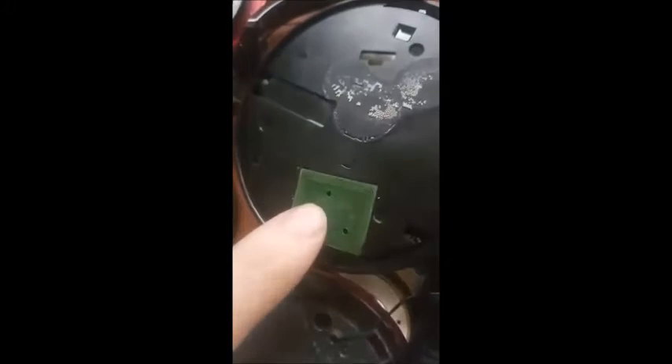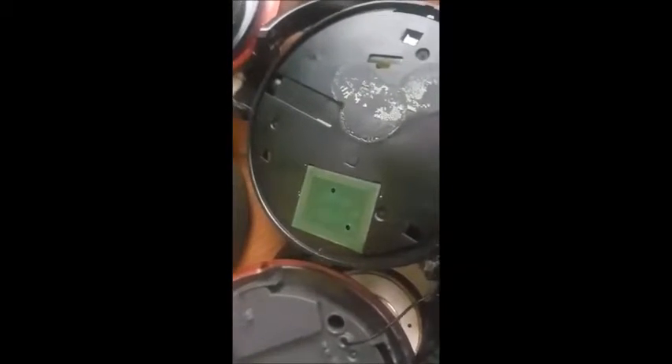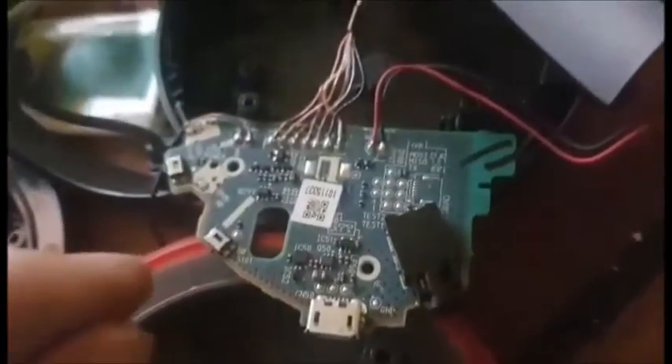With this Sony piece there's a tab there and a tab underneath on this side, then you can push it through - it's glued - and you can take out what I believe is the Bluetooth wireless antenna. Here we have the power input that charges the battery, and this is the input for your 3.5mm plug and microphone. I'm going to see if I can wire in the microphone from the headset and use it, and change out the 3.5mm to a standard one so I don't have to use this proprietary Sony one.